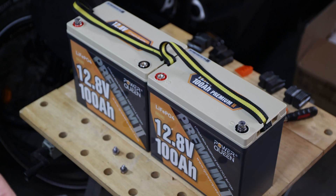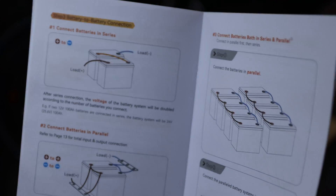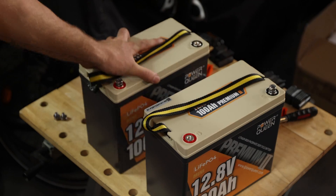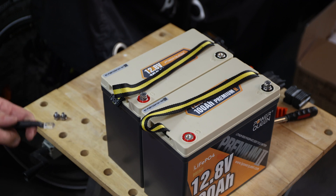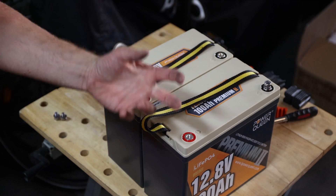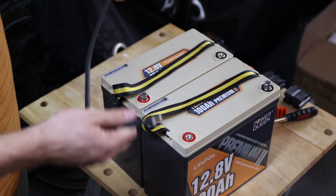I refer to page 9, but also on page 11 there is 'connect batteries in series,' and there you can see — I'll do it pretty much like they show us in that picture. We'll connect positive and negative, and because it's positive to negative, it means red or black. I'll use a black wire in this case.